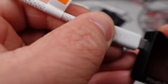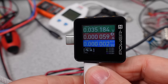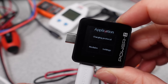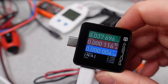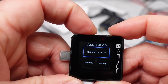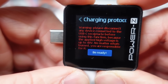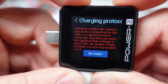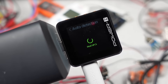These devices do often have other features, like the ability to check cables for modes of operation and read the data in the eMarker chip, or check the plugged-in adapter for the available modes of operation and the current limits in those modes. This is a bonus feature of the higher-end models. The more basic meters are typically only meters — they will let you know if you are in a specific mode, but can't set the mode themselves.